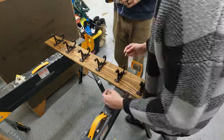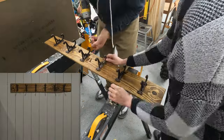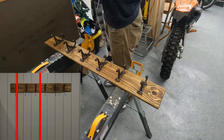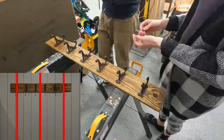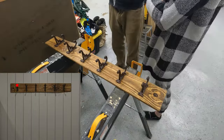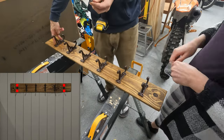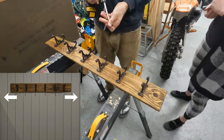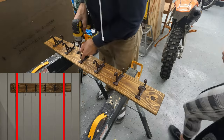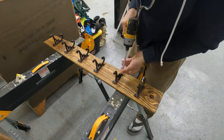One super awesome hack if you're looking to level up your coat rack is to use some of the mounting holes of your hooks as double duty for installing your coat rack on the wall. Normal stud spacing is 16 inches on center, so if you plan ahead, you can put your hooks in just the right spot so that you can use a single screw to go through the hook, through the board, and right into the stud in the wall. You'll need to know exactly where you want the coat rack on the wall in advance and where your studs are relative to that, so it can get a little complicated. But if you're up for the challenge, definitely give it a try — it's well worth it for the seamless look.